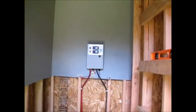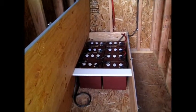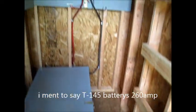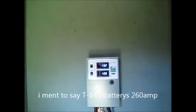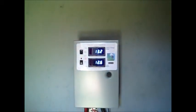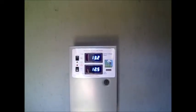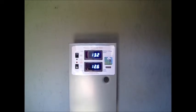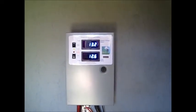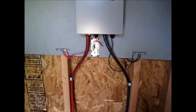Hey guys, it's SG again. I picked up four more T125 batteries and got them installed. There are two sets reading about 12.4 and 12.5 volts. I just got two 120-watt solar panels going off this 12-volt setup. Batteries are now reading 13.2 volts and we're getting 12.6 amps from just those two panels.